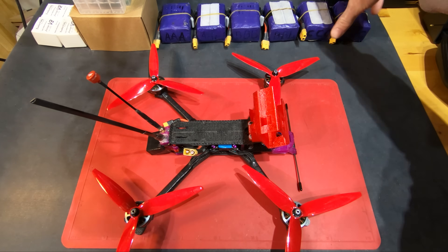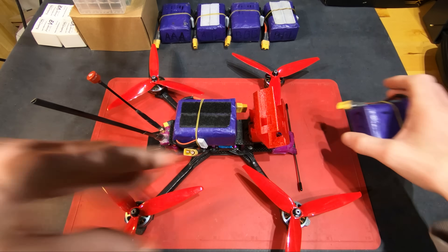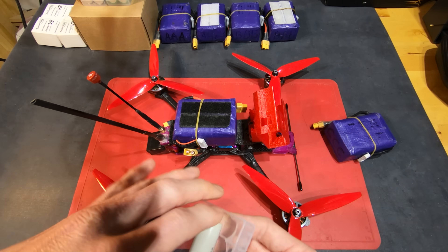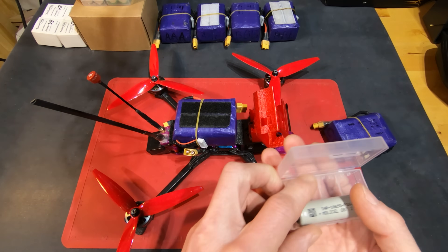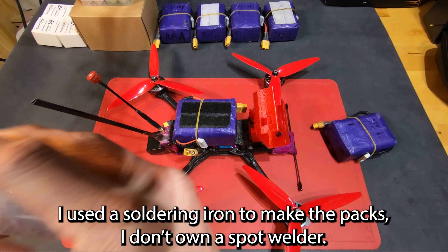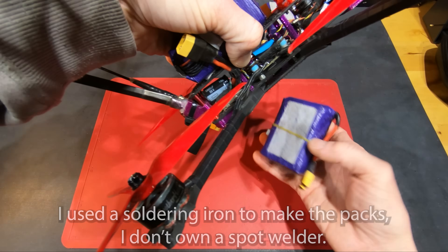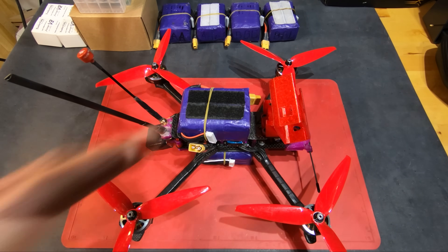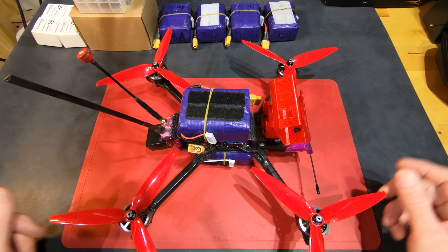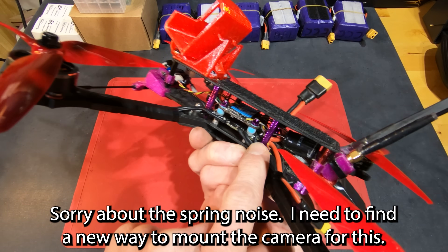Let's take a look at the batteries. I've been using my own 6S Lithium-Ion packs, made myself out of the Molicel P26A 18650 cells — I might do a video about making a battery. I've been running two of these in parallel so they can handle the amperage from the motors better, since it gets split between the two packs. They're connected in parallel with two pigtails soldered to the same spot on the ESC.